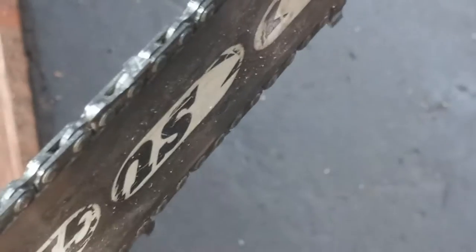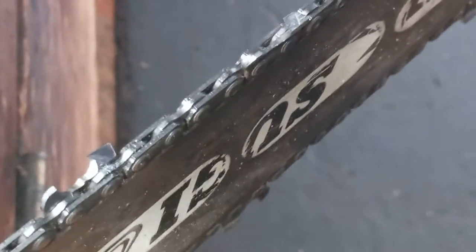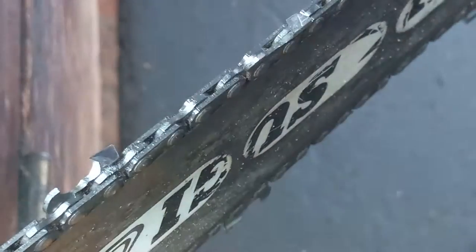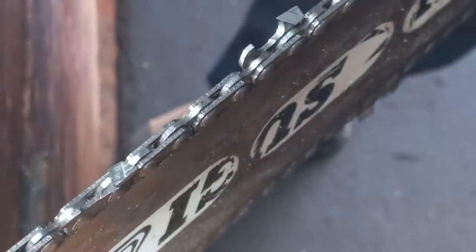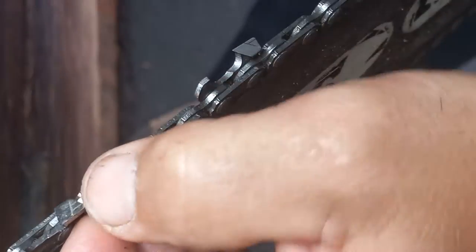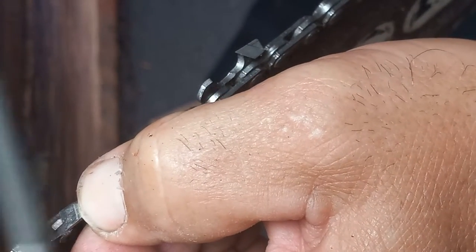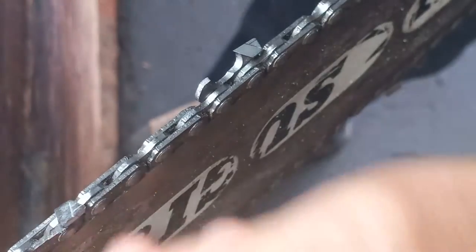We'll get set back up here. Hang out with me for a second. Boy, I make this hard, don't I. This one was doing okay, so we'll just go to the next one, do the same thing, keep it about the same. I'm looking at this guide mark versus the working corner — the edge of the cutter for my link — and I'm just going to take the same amount off of this one as I did that one, keep them the same length.